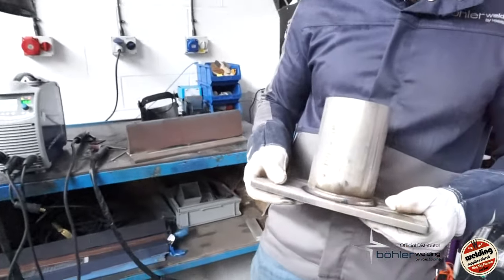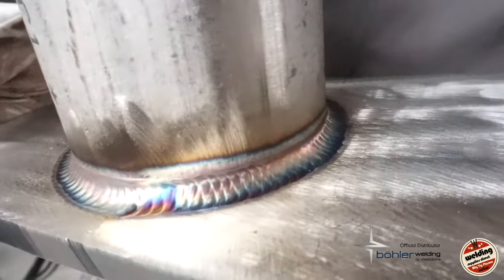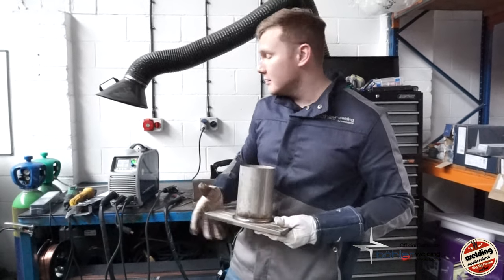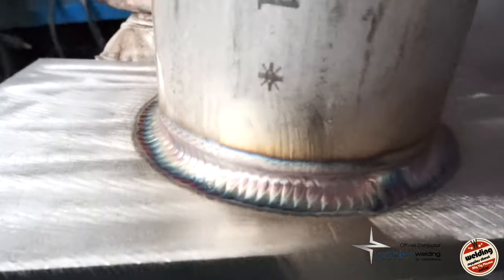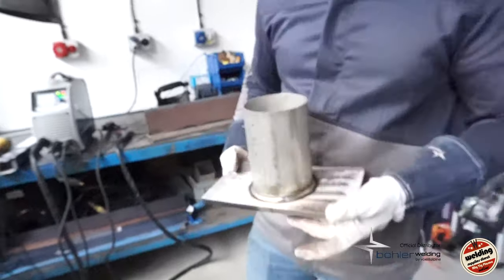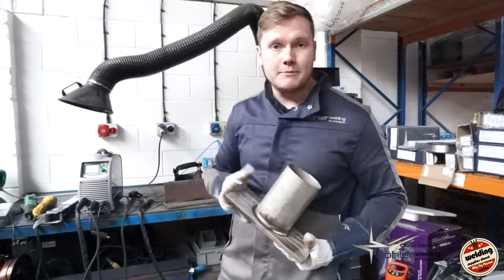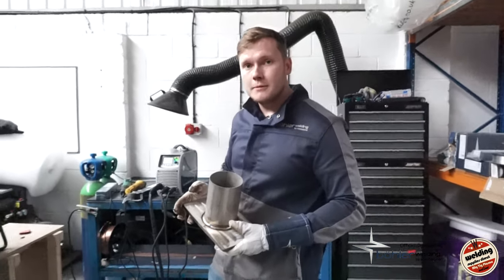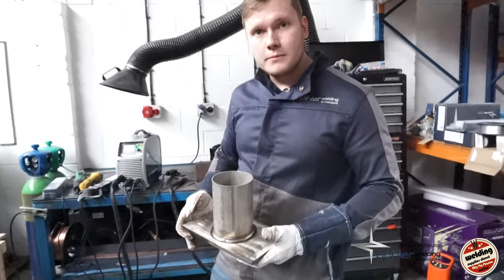Just finished up with the TIG — how do you think it went? It's a really nice machine for TIG. Apart from not having HF ignition this is a full process DC TIG welder — anything you can do with a standalone DC TIG you can do with this machine. I'm very impressed — not many multi-process machines push out a weld that comfortably on DC lift TIG. The pulse is just that nice little extra feature. On duty cycle — at around 180 amps the machine will run all day. It's got a duty cycle of 200 amps at 35%, which I think is best in class over all competitors.